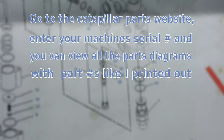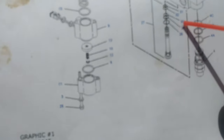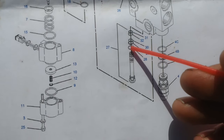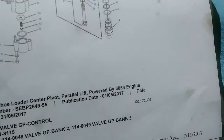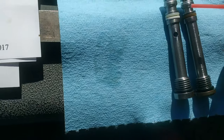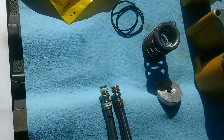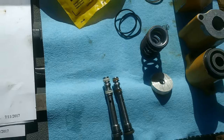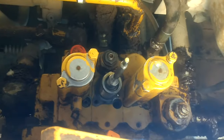Looking at the diagram, if you look through the part numbers and the names, it will tell you which one's the O-ring and which one's the backup ring. Because when you buy the part new from Caterpillar, it comes in a baggie and the O-rings are just loose in there and not put on. So you'll have to put them on yourself — make sure you install them in the correct placement. I've got all these parts cleaned up super clean and I'm going to put it back together right in this hole here.